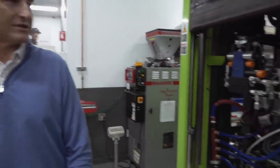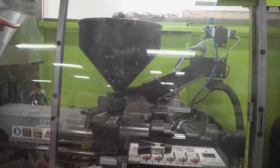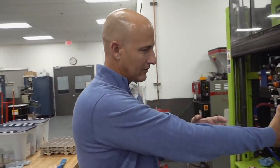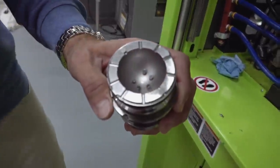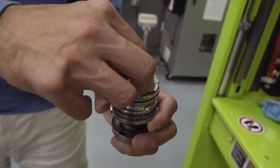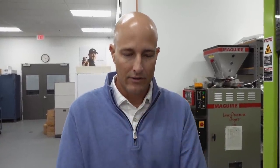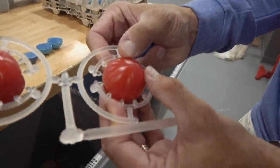For the thermoplastic materials, the materials start out in pellet form and get loaded into the retractable pin injection molding machine. The material gets loaded into the hopper in the back, goes through the heated barrel section, and then gets injected into this mold base through the runner system into the gates. Those pins hold the insert inside the cavity. The mold base closes, material gets injected into the cavity, and as that material starts to wrap around the core, those pins retract — all within a second. You end up with a part that looks like this with the core pins.